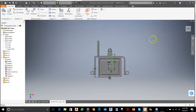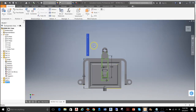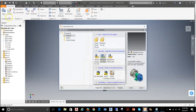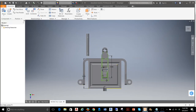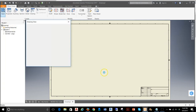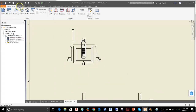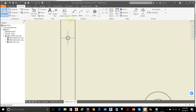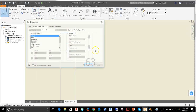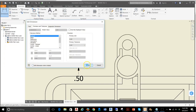An important piece here is the positioning of the shaft and what side goes where, so it's important to get some real measurements. I'm going to make sure the file is saved and lay this out on a standard layout sheet so I can create some dimensions and gain specific information. I'll grab my annotation information and center mark these two holes, because they are not at the same position from the outside edge — one is 0.63 and the other is 0.5.